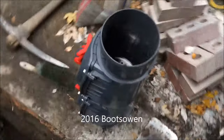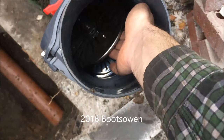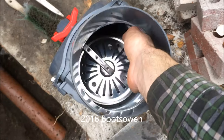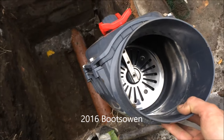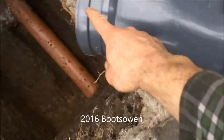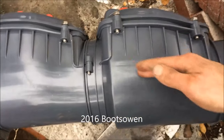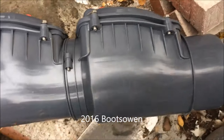We're going to put in this thing here — it's a non-return valve. If you look down into it, it has two flaps, so it's a double valve with a rubber seal on them. Normally they're closed, but if water is flowing from this side it pushes the flaps open and the water can escape. If water flows back, it just pushes against the valve door and can't get back up.